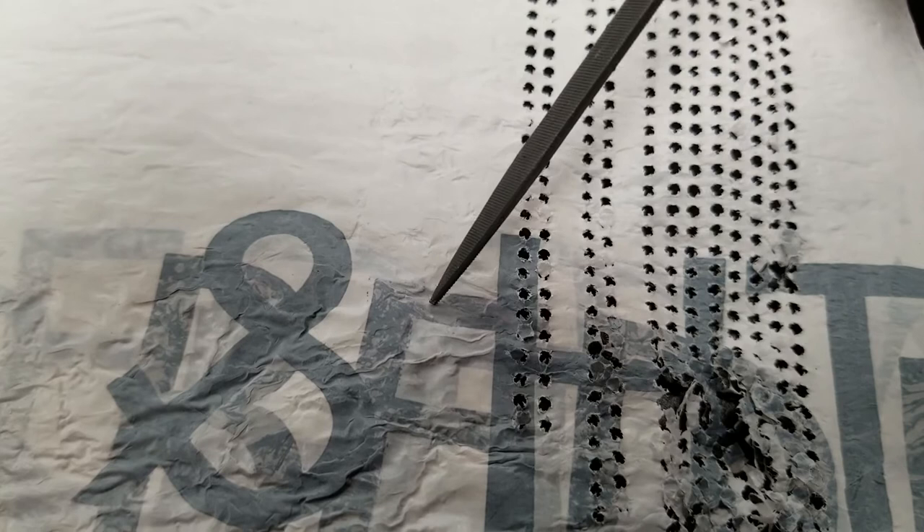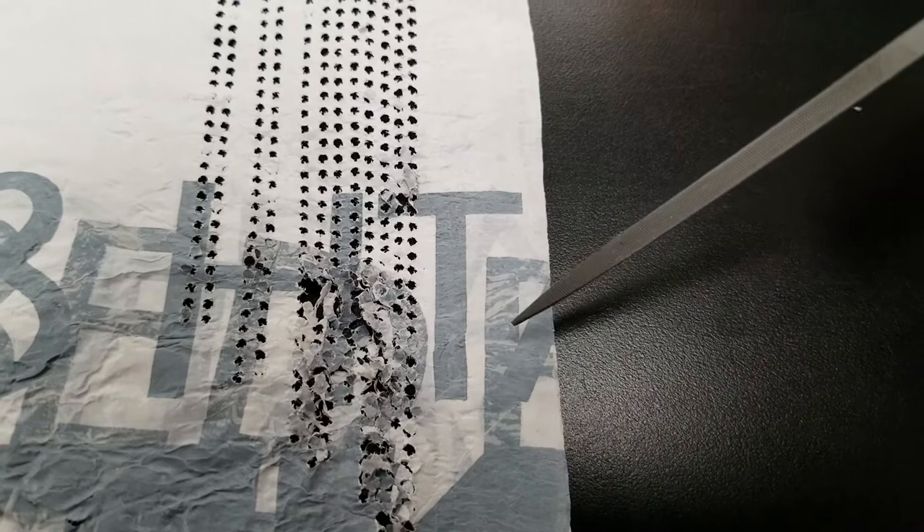If you flip it over, the dark black color is indicative of areas ironed together where there's ink. But you can see where the ink goes from dark down here to light and then back to dark — that means one layer didn't iron and stick to the next layer. These light streaks are where it didn't adhere together. We didn't press all the layers together and iron them well. This needs more ironing to close those big open gap areas.